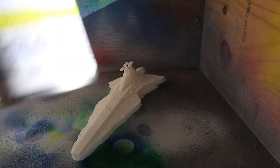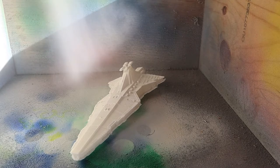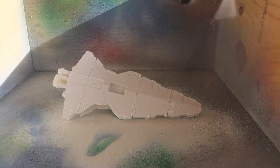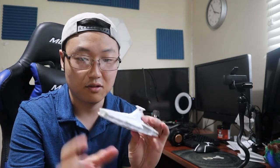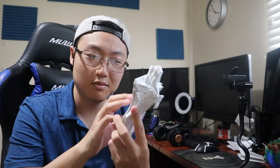The next step is to soften up the surface. I have some white paint and some fast-drying polyester. I do the white paint first for one layer and then the polyester spray for the next layer, repeating this a couple of times. The reason is that the dry polyester and white paint combine well together, so those holes and gaps disappear after a few coats. After the painting and polyester spray, the result is very smooth — you can still see a little bit of ridges, but I think those will be corrected with airbrushing and gloss spray paint. If anyone has advice on getting rid of gaps when gluing 3D printed parts, let me know in the comments because I'm still a beginner.